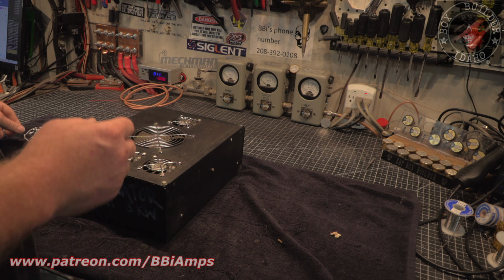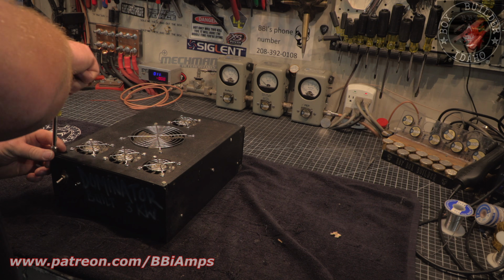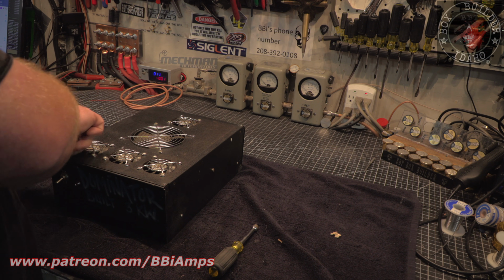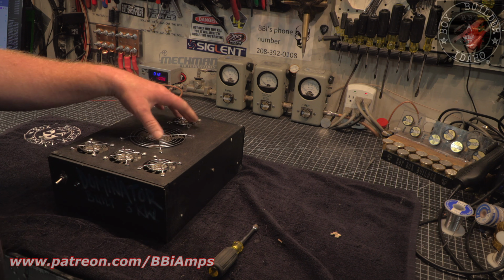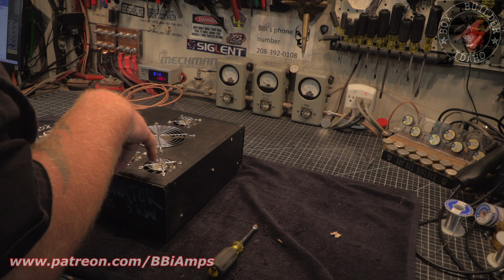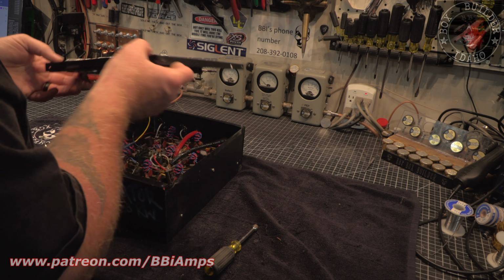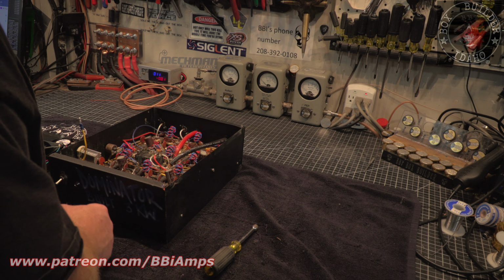So guys would start adding fans to their Dominator, Skullcracker, Foxy style of boxes because the boxes would get really, really hot. Of course, every CBer thinks heat equals more fan. Well, let's say you've got one high CFM flow fan, and then in this case we've got 3, 4 smaller CFM flow fans. This fan might overcome these fans' abilities to push air through the cabinet, and air being like water, it's going to take the path of least resistance out of the cabinet. Might end up flowing up here, so this could cause a problem, but ooh boy.